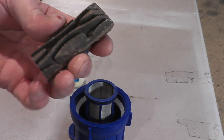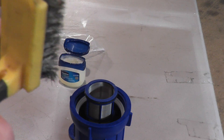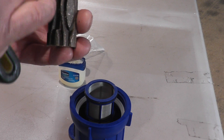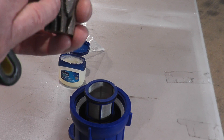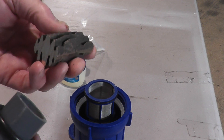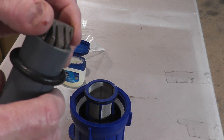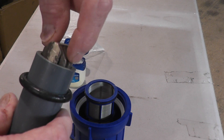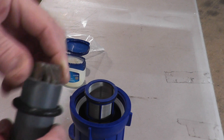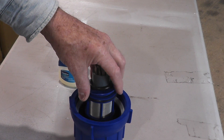The bullet core can be very different colors depending on your water — it could be green, brown, or red. Use a small wire brush under running water and scrub it end to end, getting all the way down into the envelope and crevices. If yours is really dirty, soaking it in vinegar for three or four hours helps a lot. Make sure the bevel — not the flat end, but the bevel — points up. Water comes in from this direction and hits the bevel, which creates turbulence in the water and helps the catalytic core do its job. Then the top sits in here like so.